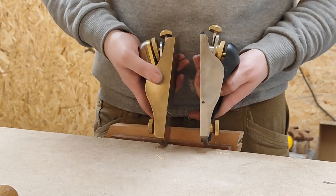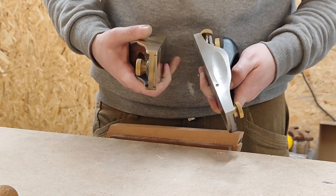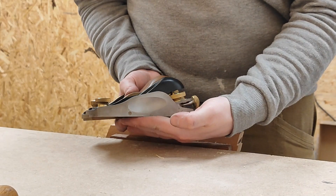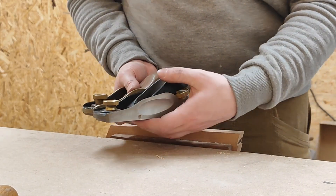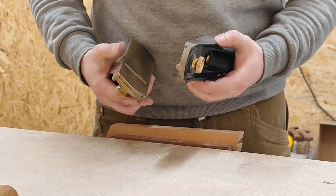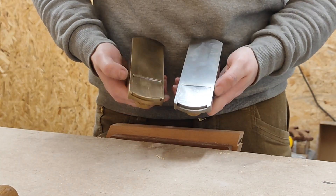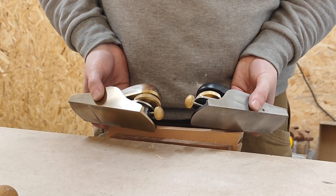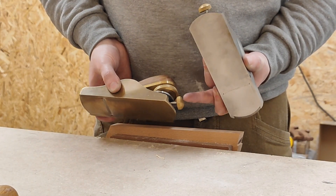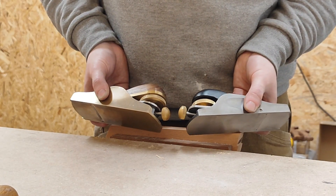The planes are virtually the same size, same profile almost. Same adjustment mechanism — a wee foot at the front that moves forward and back, adjustment screws at the back, lateral adjustment side by side, and a centre screw to clamp it down.